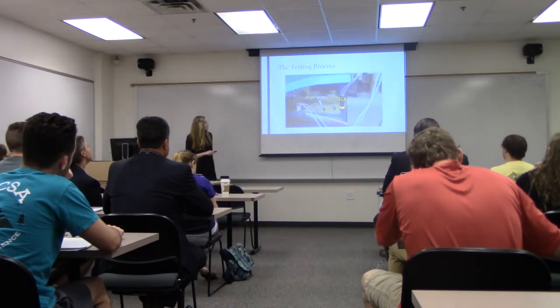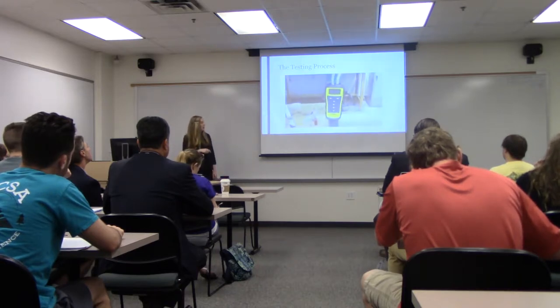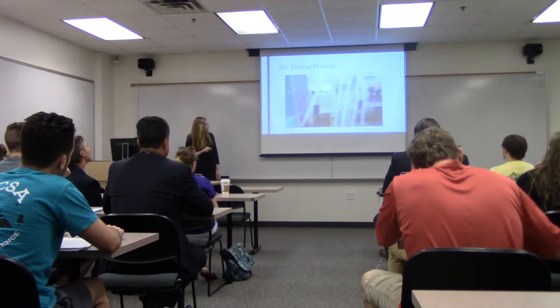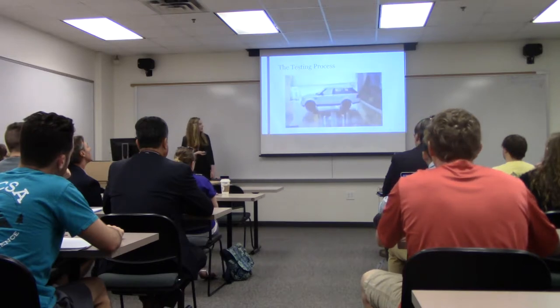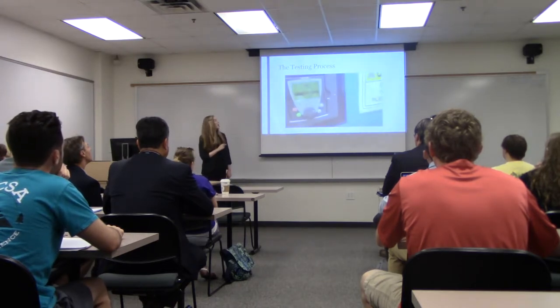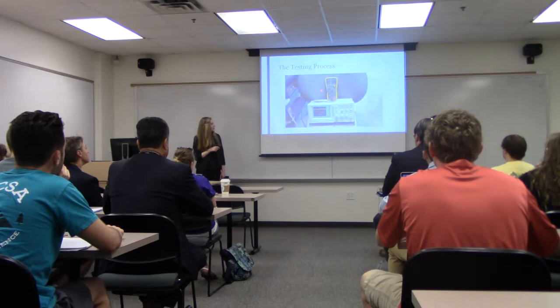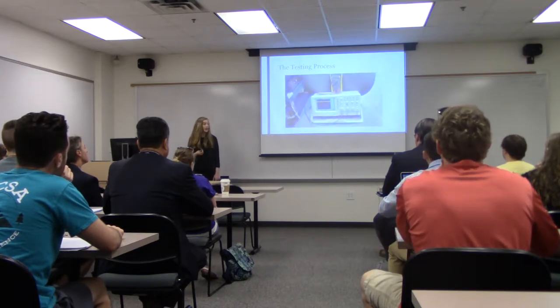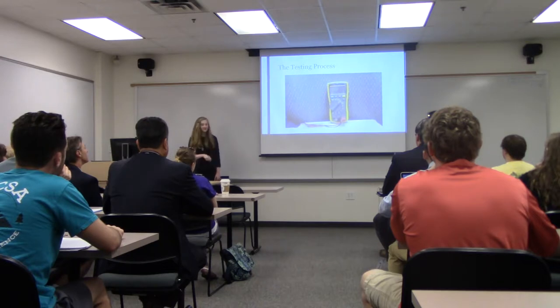All right, so first you see the digital and U-incline manometers, and that's what I use to measure pressure in the wind tunnel, measured in kilopascals. This is quickly the pitot-static tube. This is the model mounted in the wind tunnel test section to the dynamometer. And this is the wind tunnel blower controller, set to 60 hertz, which is the max speed that I was able to test at. And lastly, this is the voltmeter and oscilloscope, both measuring drag voltage. And right here, the V average value should be approximately the same as the voltmeter readings above.